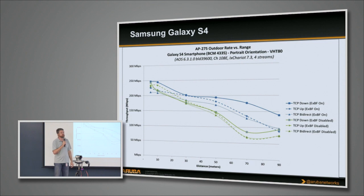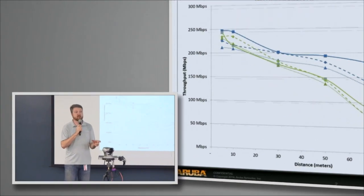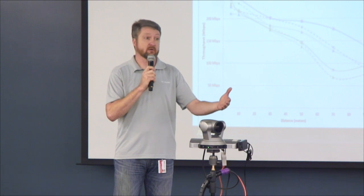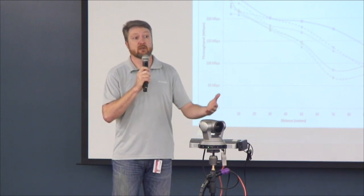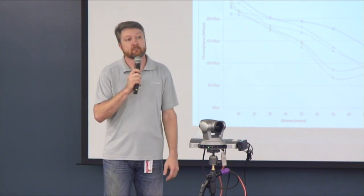For a metro deployment, you're typically no more than 400 meters between nodes. The client will connect a lot further than that, but the rate you get at extreme range isn't that usable. At 400 meters apart, that's a 200-meter radius — so you're essentially in the center going to one node or the other. This AP will also be one of the first we've shipped that will support the full ERP in every regulatory domain — all the way to 36 dBm ERP if the regulatory domain allows it on that channel. That would be used for bridging applications.